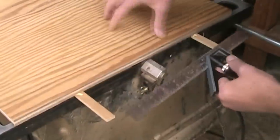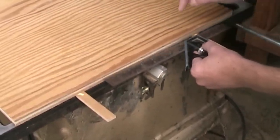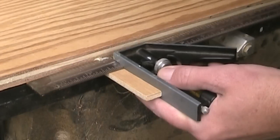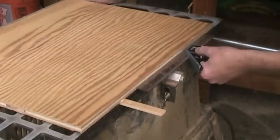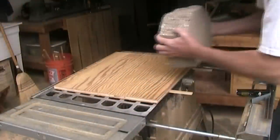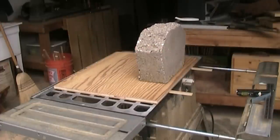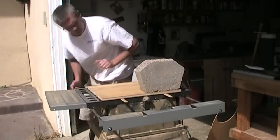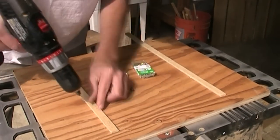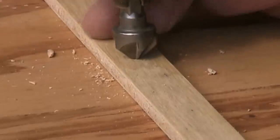With those runners in, I've got them sticking out just a little bit beyond my table saw, and I'm going to apply some glue all the way down each of the strips. Now I can take that board I cut and square it up with the end of my table for now. On this back edge of my table saw, I'm going to use a combination square to line my runners up to the board, making sure it's really square up against these runners. Once I've got it into place, I'll put some heavy weights on it and let it dry.